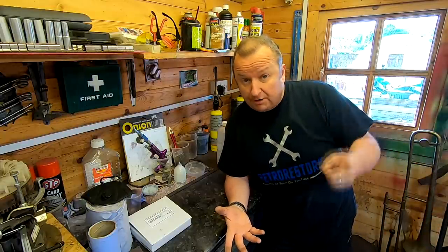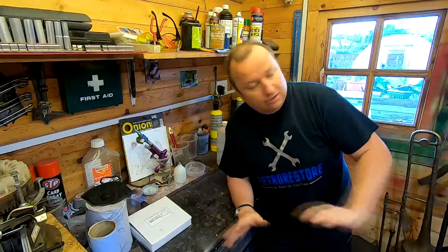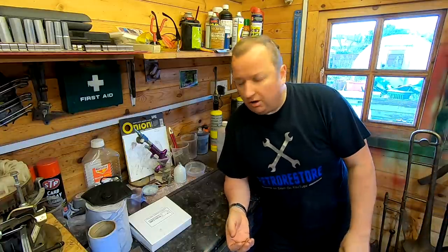See, that's the only difference when you're painting the deck by hand with a spray gun. You've got to wait, or even with rattle cans, you've got to wait for the paint to actually dry, and that's a good probably 12, 24 hours. I know a lot of these are touch dry within about 4 or 5 hours or whatever, but when you're assembling something, you're pushing pressure on with your thumbs and your fingers, and that will leave indents in soft paintwork. Where the powder coating, as soon as it's cool, that's it, it's rock hard, no worries with that whatsoever.